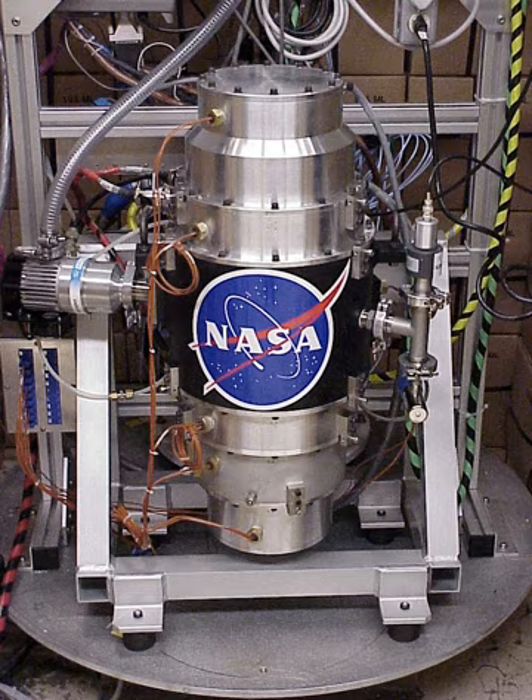For single-material, isotropic rotors this relationship can be expressed as: e_i = k · (σ / ρ), where e_i is the kinetic energy of the rotor, k is the rotor's geometric shape factor, σ is the tensile strength of the material, and ρ is the material's density.